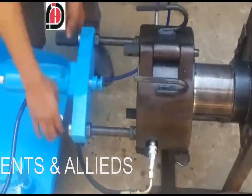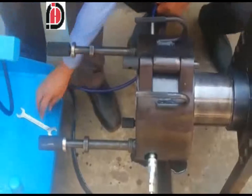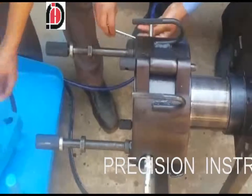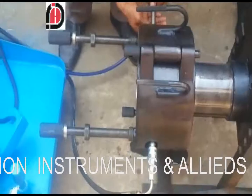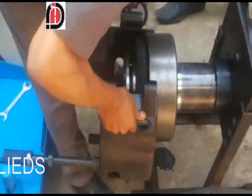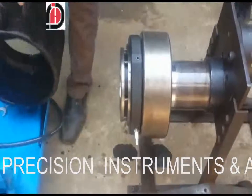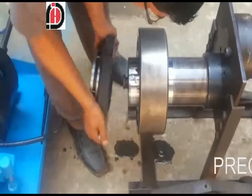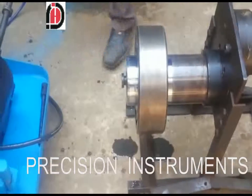The cylinder is removed and the hydraulic hoses are also removed. The bearing is easily taken out of the axle. The housing is taken out and the locking nut is removed. You can see the oil on the floor which has penetrated into the bearing.